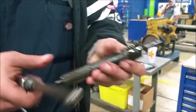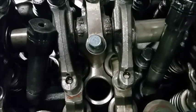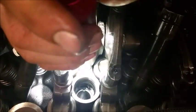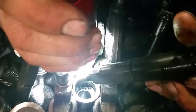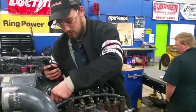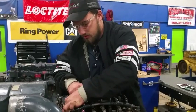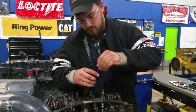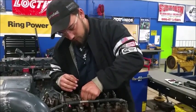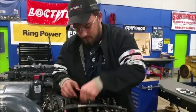The fuel nozzle is right here. When you go to put these back in, there's a little pin right here, so you want to look down in the hole with a flashlight. There's a little notch down there to where that pin goes in, and it slides in. You'll hear it click — that's how you know it's in there. Just go to your next one and repeat what you just did. That clicking noise will let you know the pin popped into place.